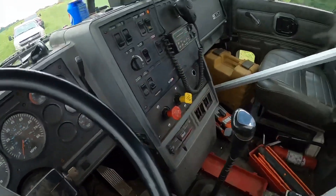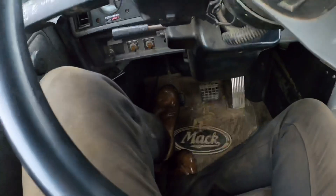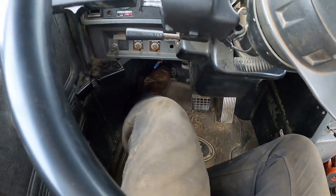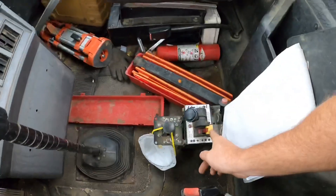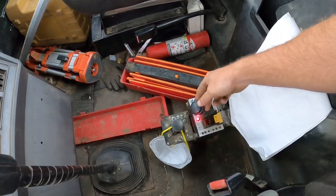We just got backed in here. Now we need to put the trailer down. To do that I need to engage the PTO — push the clutch all the way down, engage the clutch brake, this turns the PTO on and engages the hydraulics so we can operate.